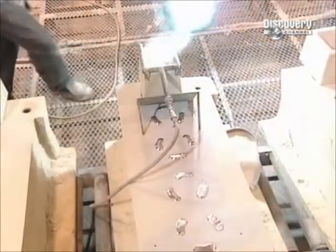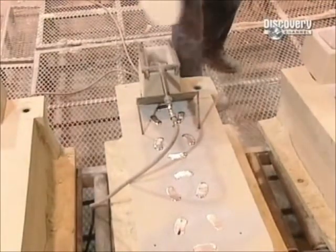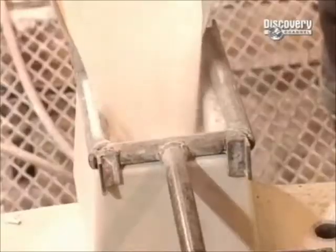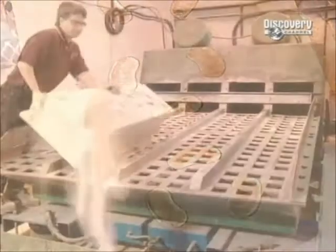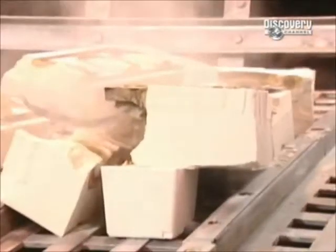Magnesium, heated to 700 degrees Celsius, is poured. Then the spout is blocked to prevent the metal from reacting with air. The metal takes about 10 to 20 minutes to harden, after which a vibrating conveyor breaks the mould apart.